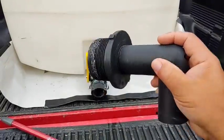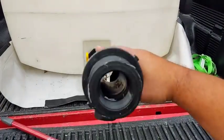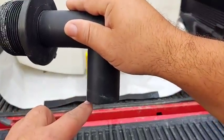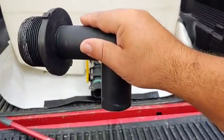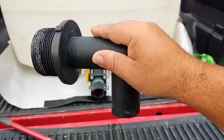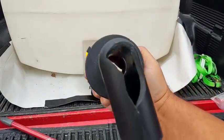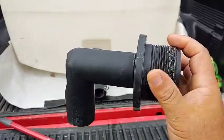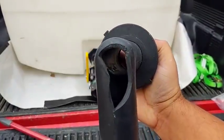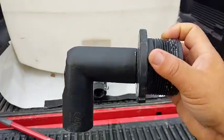This is what it looks like in there. When they put it in, they put it from the inside and then screw that big nut around it. This part is almost towards the bottom of the tank so that it can siphon out all the water, or almost all of the water. What happened last winter is that when this part froze, I went in through the outside with a long screwdriver to try to knock out the ice — and look at what I did. I must have knocked it off the threads and it created a leak. This is pretty easy to happen if you do something senseless like that, especially when you don't know what the inside looks like.